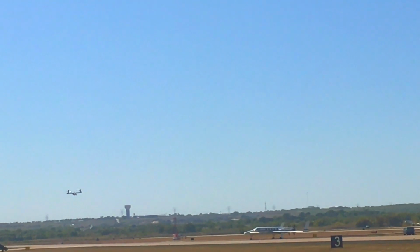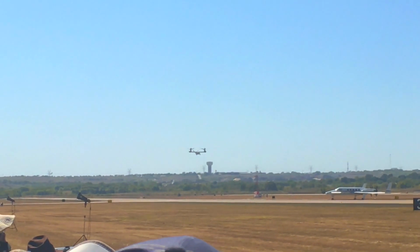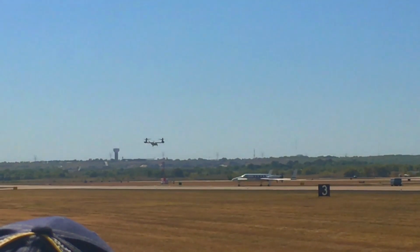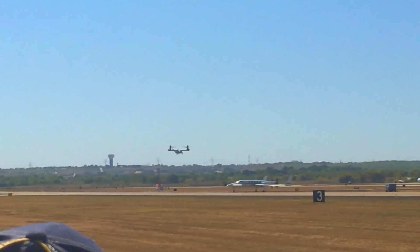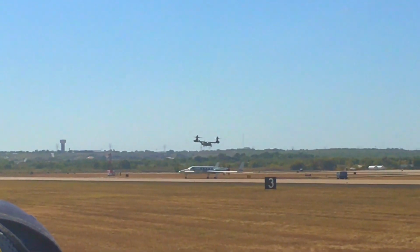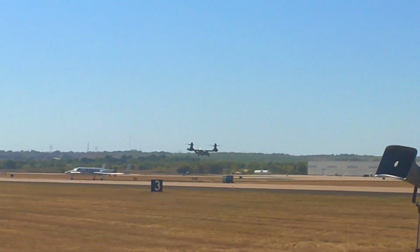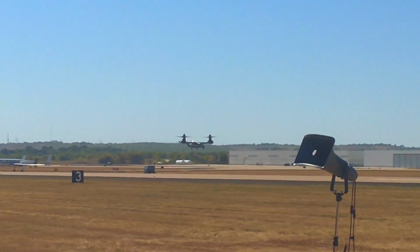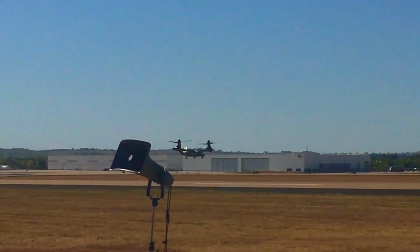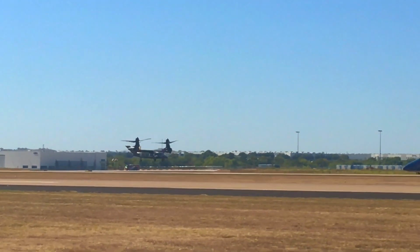The ability to do a roll-on landing in tiltrotors not only provides more capability, but adds a survivability element to the aircraft. This allows the crew to stay on the wing longer, thus reducing the power required to execute a high gross weight or emergency landing profile. Once the aircraft has touched down, the pylons can be rotated back to the 95-degree position, providing braking action to assist in slowing the aircraft to a stop.